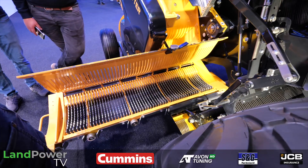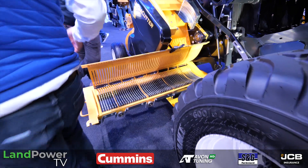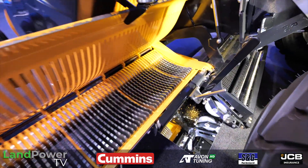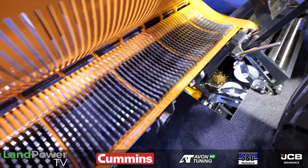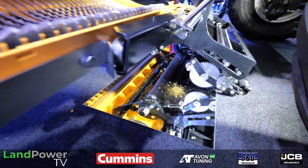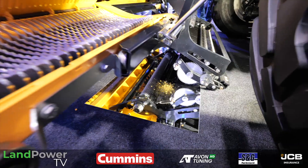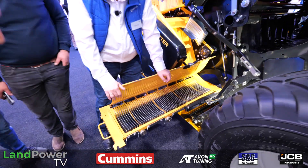Can you do the knife selection from the cab or from the screen? The knife selection is done mechanically. The knives are individually spring-protected and hydraulically engaged/disengaged, but the knife selection is done via a small crank that you turn to set the knives to either 14, 28, 29 or 57. On the 29-knife unit you have 7, 14, 15 or 29.